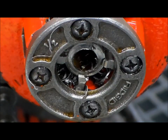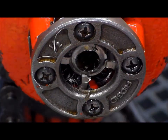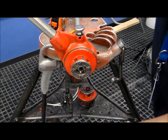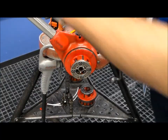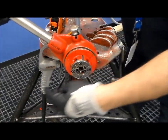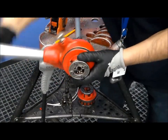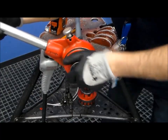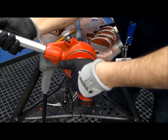We are now going to remove the die from the pipe by turning the die in the reverse direction. You'll notice in this close-up that it does say this is a half-inch die, and if you had any other types of dies, it would be marked on the front. To remove the die from the pipe, we need to reverse the ratchet. By turning this dial, it allows you to unwind the pipe from the thread — so now instead of turning clockwise, you can turn counterclockwise. The thread should be loose enough where you can spin this by hand and keep spinning it until you remove the die totally from the threads.